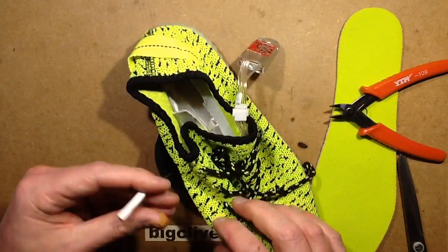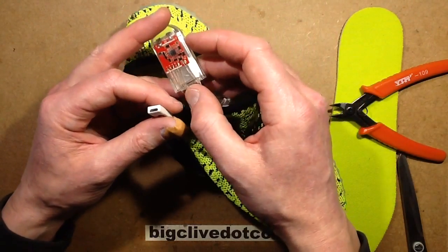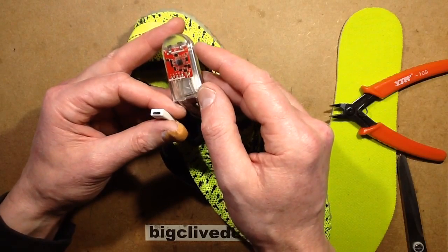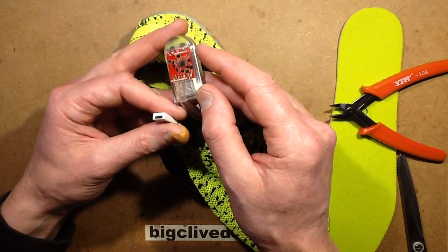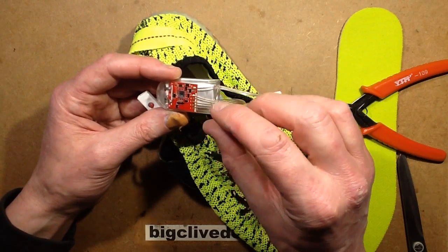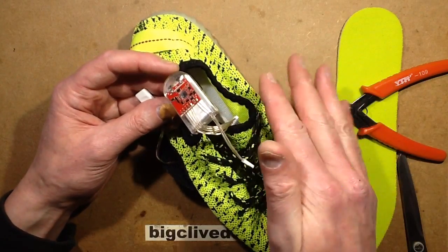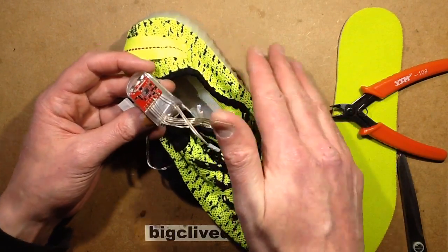So that would mean, effectively, that this must be going via a diode to charge the cell via the protection circuitry. I'm also looking at the wiring here. I'm only seeing 5 wires. That would suggest red, green and blue and maybe the 2 commons. So they're actually alternating between those. That would also go with the animation. So that would be the alternating effect.